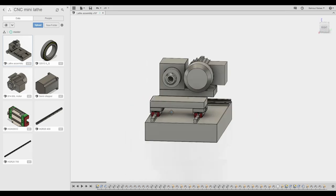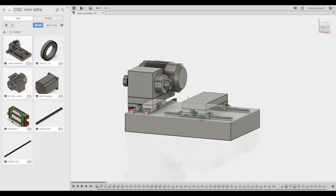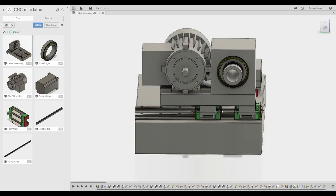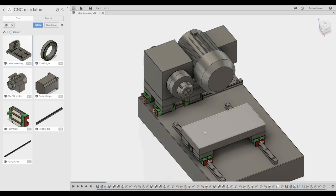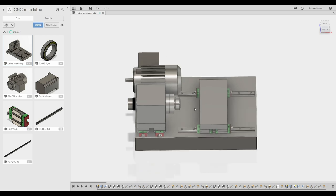So this is the design I have so far. It's obviously not finished yet — we still need to add ball screws, all the associated bits and pieces, bearing blocks, ball nuts, pulleys, belts, belt tensioners, an encoder, and the stepper motors. It's built off a granite surface plate, and the reason for that is it's a nice reference flat surface which should help with accuracy, as well as the fact that I can't actually machine a base that big — I just don't have the machines to do it.